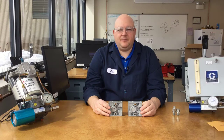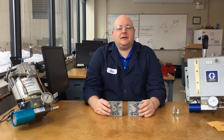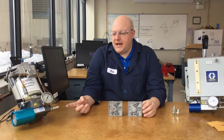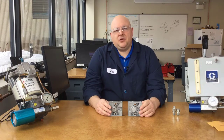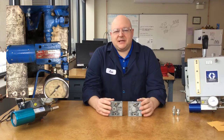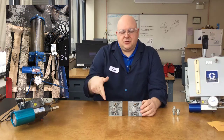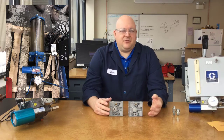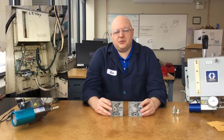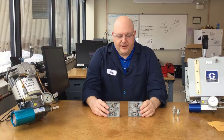Another option for the base plate manifold is the wall mount manifold. Wall mount manifolds exist because the AL and HL series pumps actually predate the Moduflow family. Those pumps now all end with an M — for example, ALS 25M — where M stands for Moduflow. Older units from the 1970s might say ALS 25C or HLJ 5B, with a B or C instead of M, meaning they were wall-mounted with the reservoir mounted above, gravity-feeding into the pump below. We even have one of these on a machine in our factory. Occasionally people send in pictures of old AL or HL pump systems that aren't Moduflow because they don't mount directly to the reservoir.